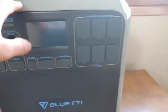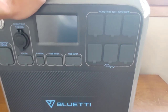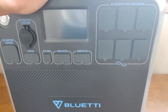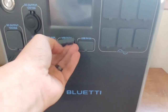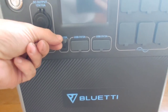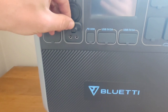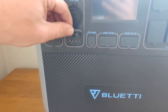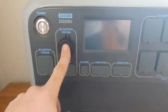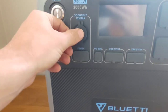And then as far as the output goes, you have your AC output. It's a 2000 watt inverter, pure sine wave, which means you don't have to worry about plugging in any of your sensitive computers, stuff like that. It won't damage it at all. Your USB outlets, USB A's, I believe they are, USB C for cell phones. I think some MacBooks are doing them now. These little DC outputs, I believe, are for some CPAP machines. You can get a connection that has that so you can run directly off the DC instead of going through the AC. The 12 volt outlet, cigarette lighter, which is what I am going to use, I think, mainly